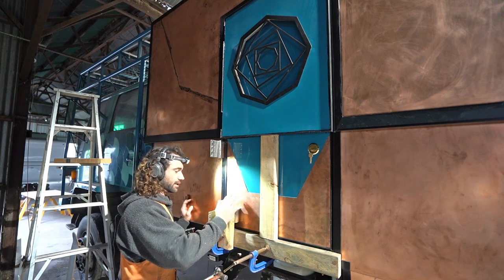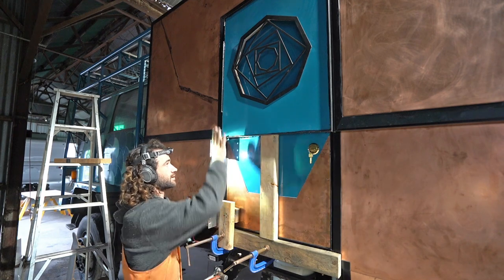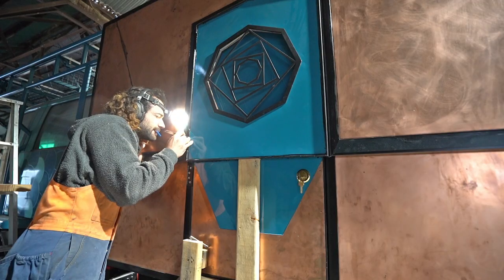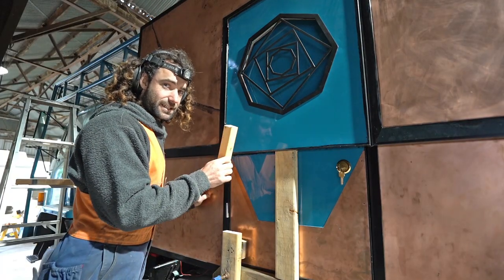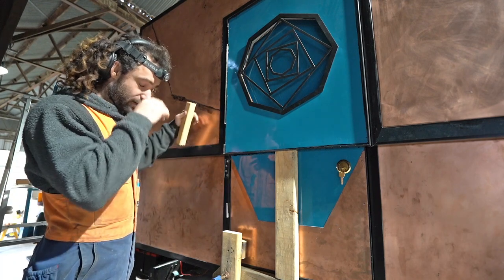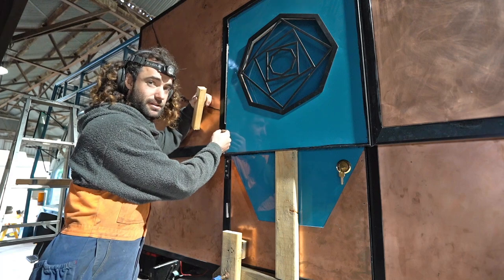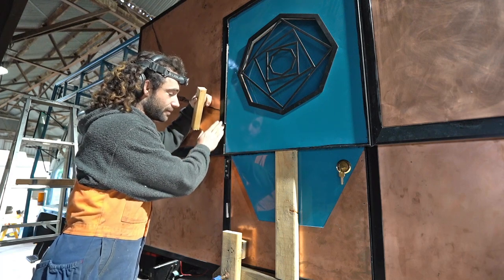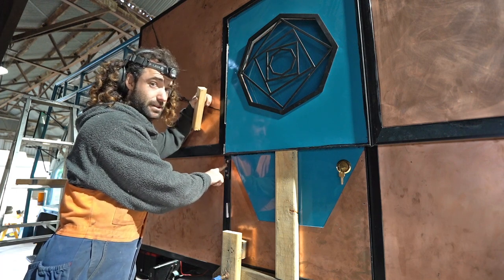That block and packer in there will compress the lower part of the seal, so now the seal should be compressed all the way up — it's 10 mil. I've been doing some quick maths on this block of wood here and I think I've worked it out. The top hinge center line will be 16 millimeters out from the body of the truck, and the lower hinge center line will be 60 millimeters out from the bottom of the truck.